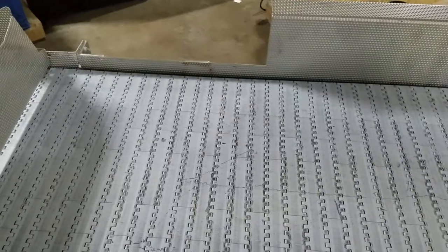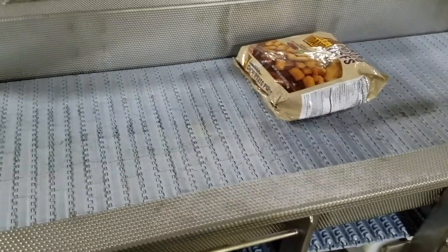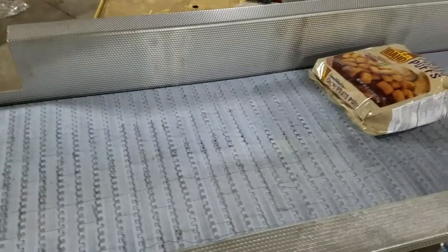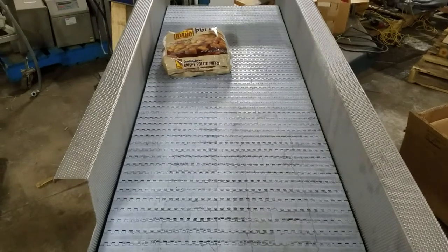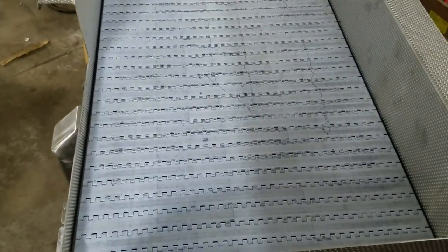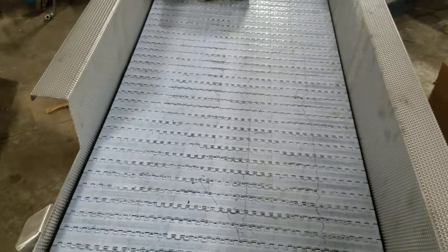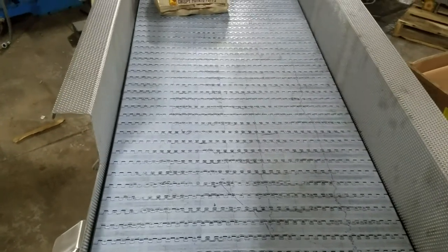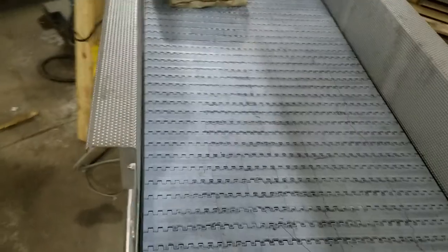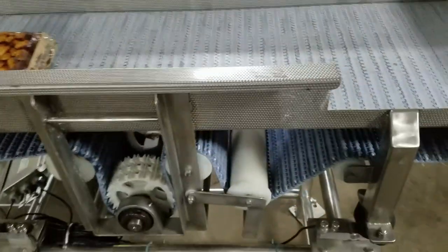We can work around that — I just need to know what you want, because it's going to require some wiring and changes, which I'm more than happy to do. I just don't want to set it up in a configuration that isn't what you're anticipating. So the big questions are: do you want the conveyor speed adjustable? Are you going to stop and turn off your in-feed onto the conveyor? And how do you want the flap to actuate? Just a few questions there would help me get this set up so that when it hits your floor, you only have to make minor changes to the target weights and it'll operate more closely to what you're looking for.